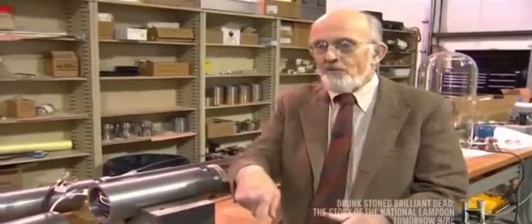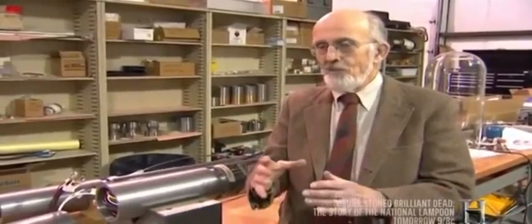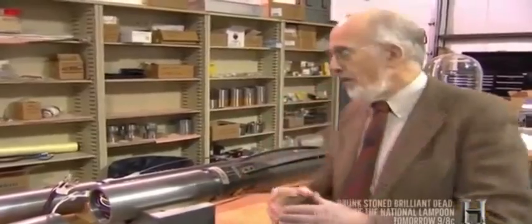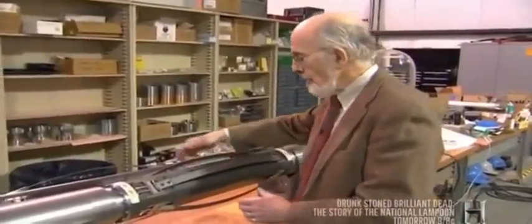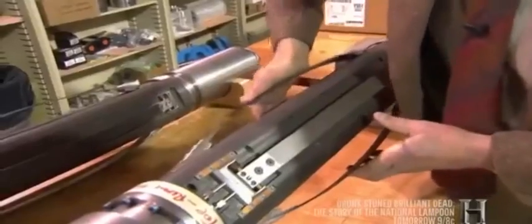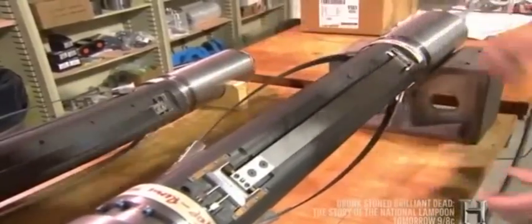If you have one piece rotating, you have to have something for it to provide resistance to that rotation. And that's what this anti-torque section does. The anti-torque section, these are springs that I can compress. They extend out and are pressed up against the wall of the hole. To date, scientists have been able to uncover over 1 million years of climate history through ice coring.